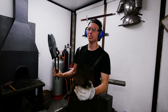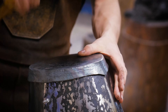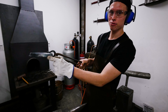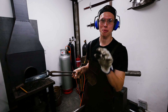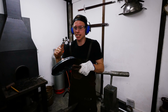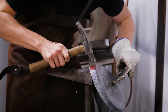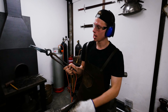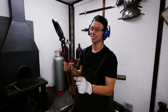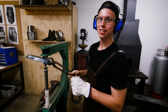We're just about done the first pass of bringing the edge down to just get the sides in for the top of the helmet. There's this cool little detail at the front — the steel kind of comes down into a little beak shape. That's because as we bring the steel together into a point it's squishing material, and that material has to go somewhere, so it's moving out towards the edge of the plate — that's how we get that little peakiness on the corner of our roll.